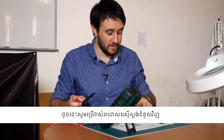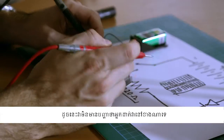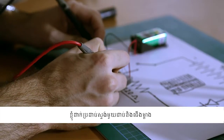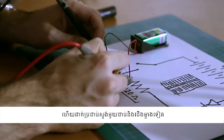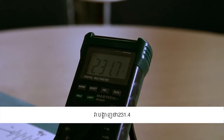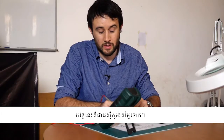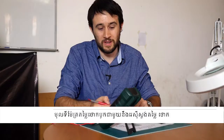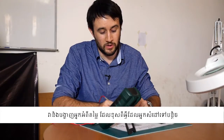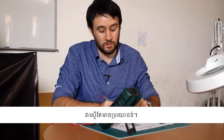So let's use that and measure a resistor instead. Resistors are non-polar, so it doesn't matter which way around you do this. I'm going to touch one probe to one leg and one probe to the other leg, and the resistance reads off. It's saying 231.4. I told you that was going to be 220. This is a cheap resistor, so a combination of a cheap multimeter and a cheap resistor gives you a value a little bit off your intended target. But it's close enough to be useful.